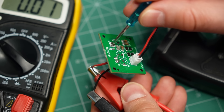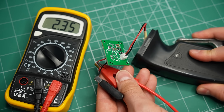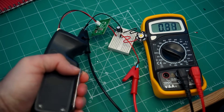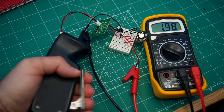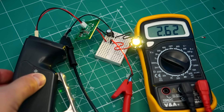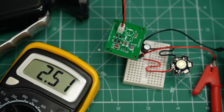Right now it is set to about 2.4V, but I'm going to increase the output to 2.6V, which is just below the rating of this small supercapacitor. The good news is that the flashlight is charging the capacitor, as indicated by the rising voltage. The bad news? We don't get any light right away — it takes a while for the capacitor to fully charge. And even then, the LED doesn't stay on for long. It quickly uses the energy stored in the capacitor and the voltage drops so low that it cannot overcome the forward voltage of the LED by itself.